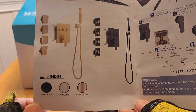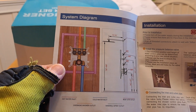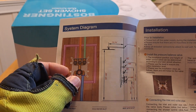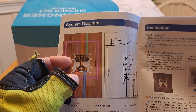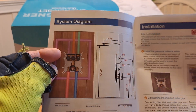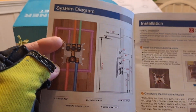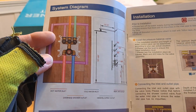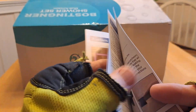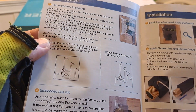It's going to be a definite to-do putting this thing in. Here are the color finishes — mine is the brushed nickel. It's all going to be PEX, and I've done some research on connecting to the body of it. I think I might be soldering copper to the PEX — using copper connections to connect it to the shower system, the valve body. I probably could get away with something else, but it doesn't look like copper from the diagram. That's going to require a little more research — I'm not anywhere near doing this yet.